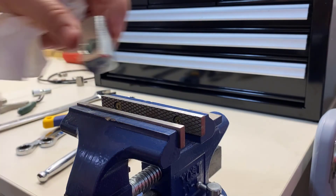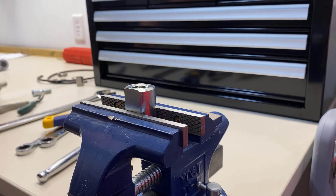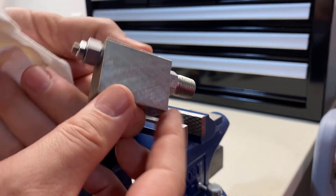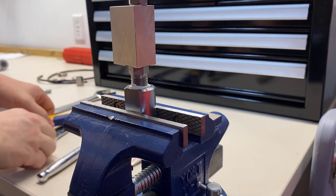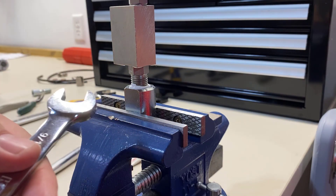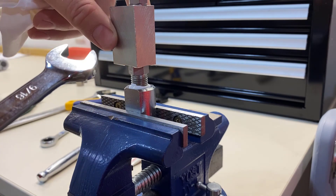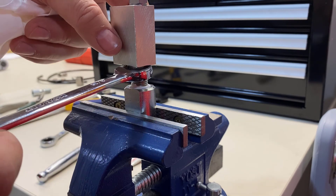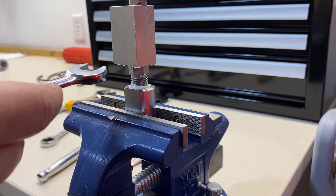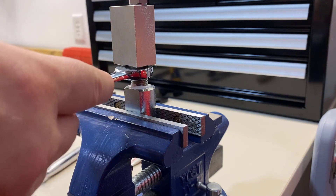Before we do that, I want to also show you the adjustable relief valve. Let's put some thread sealant on these threads too. In this case we can't use a ratchet anymore, and it's tempting to wrench onto the body of the relief valve. But down here there's a hex — there's actually a nipple on the bottom that's installed into the female part of the body of this relief — and this is where you want to put your wrench.